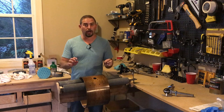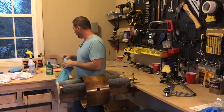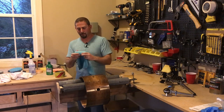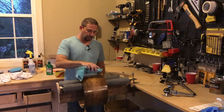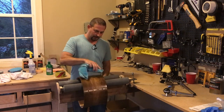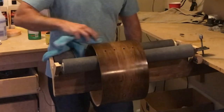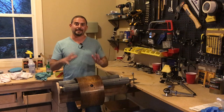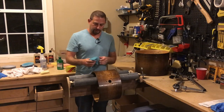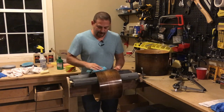The babies are fed and the drum is nice and dry. So here we take our Johnson's Paste Wax. Microfiber rag — you could also use a pad. I'm wrapping it in a foam roller I had left over. I'm going to apply some wax and just dab it all along the drum. You don't spray the drum first — the drum's got to be nice and dry, so I would even take a rag and dry it all off one last time. Now I'm going to take this and apply the wax — you go straight, you can go with the grain, it doesn't really matter so much, just make sure you get an even coat around the whole drum. Now I want to let this dry for a good 10-15 minutes at least, then come back to wipe this off. We're back — and I'm just going to start taking the wax off. The more you polish this, the better it's going to look.